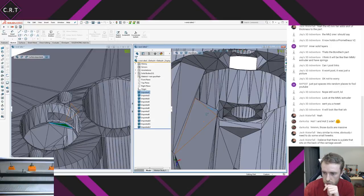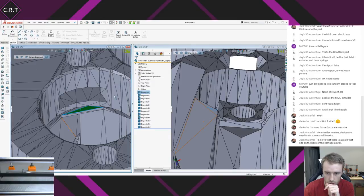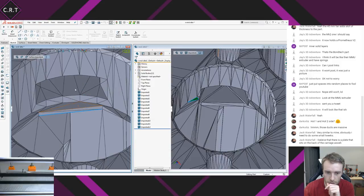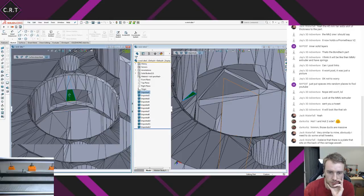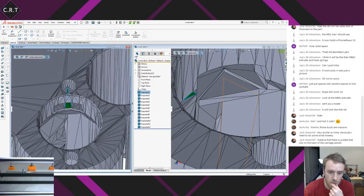So that's the square face that comes up there. That overlaps that, which is why that sticks out still. So that same thing sticks out here. We've got this other sticky out bit. And then they've got this rounded bit on the bottom. Hopefully this will print a bit better. I mean, it should just be a straight line across, probably, because why would you not? Straight lines are going to print much better than a curve on an overhang. Well, a bridge in this instance.